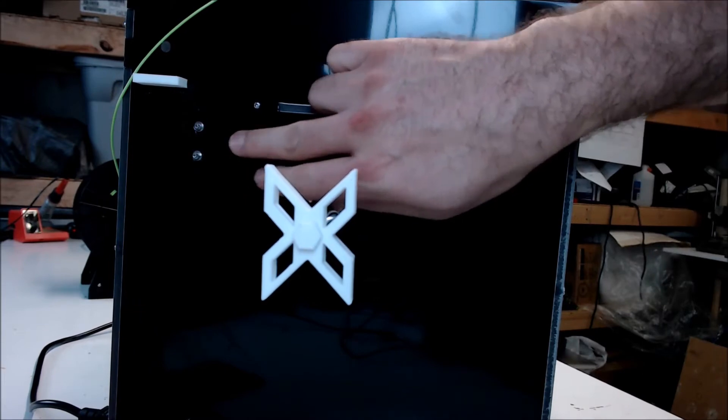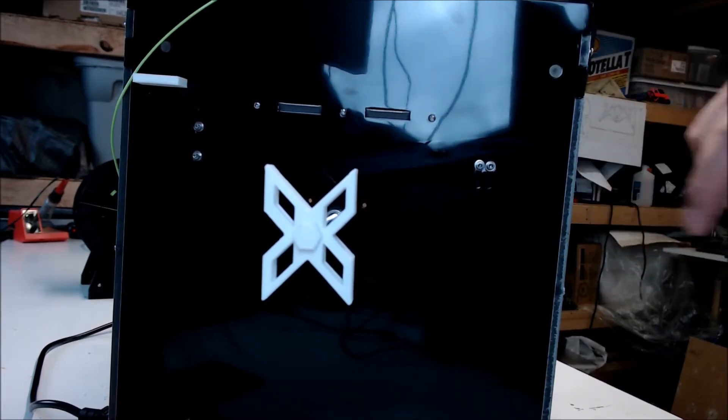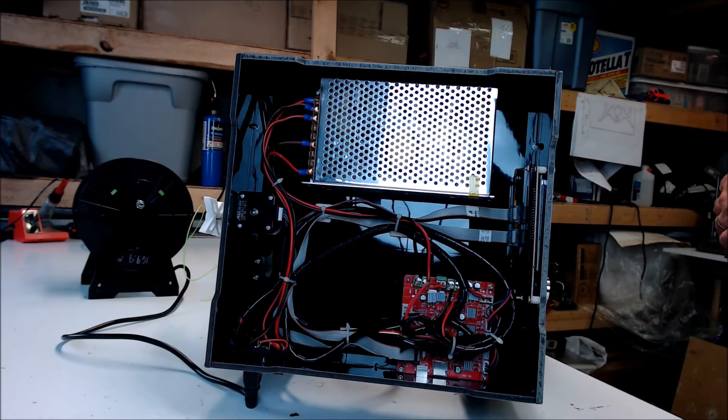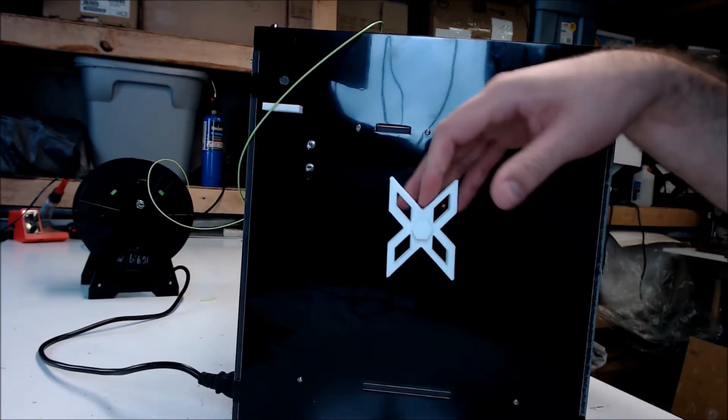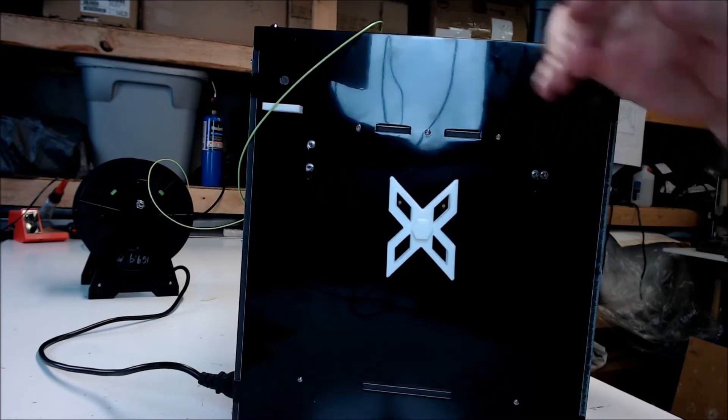It's much easier to move around with a click knob than on a lot of other printers. Adjustments are pretty easy to make with the location of the motor mounts and the end stops — just be careful when tightening them, as they are mounted directly onto acrylic. The electronics and power supply are tucked underneath to give it a nice neat look. It does have a makeshift spool holder and filament guide on the back, but nothing very useful.